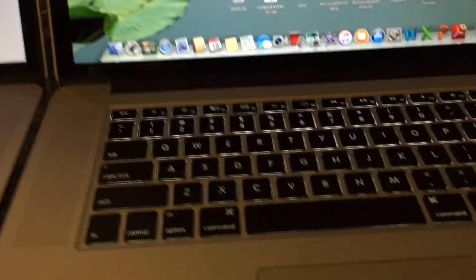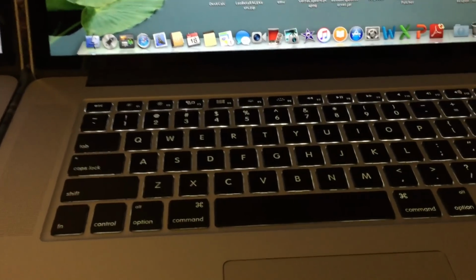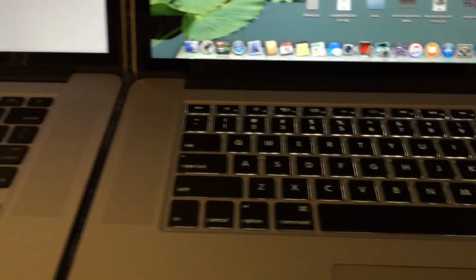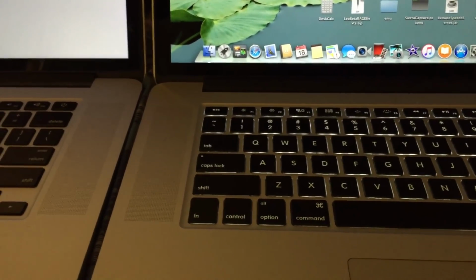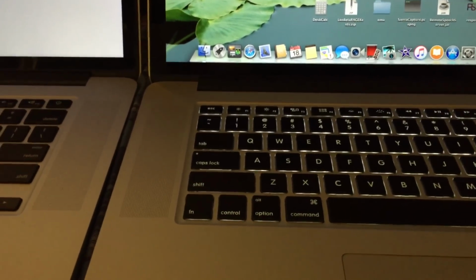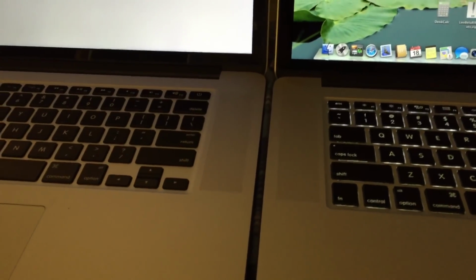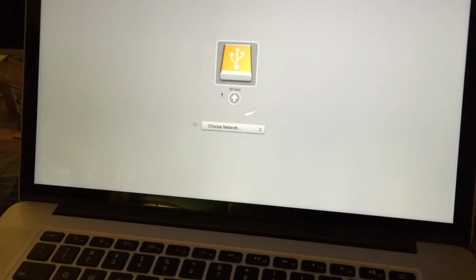Of course, Apple, being Apple, will not let you simply download and install an older system firmware version using the standard software update or the standard firmware update utility in the system. So I will have to do this through Linux using Flashrom. Now, of course, with that being said, we must have a source to get the older firmware version from, and of course that's where this machine comes in.